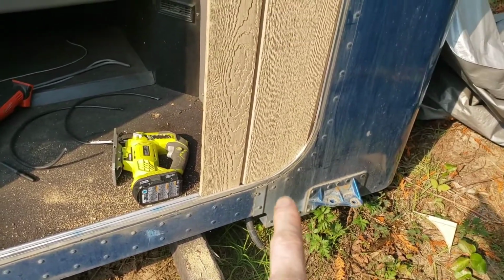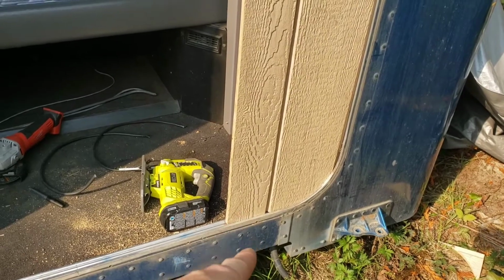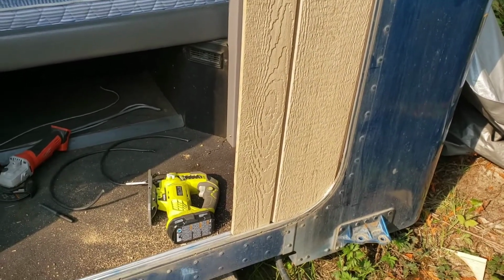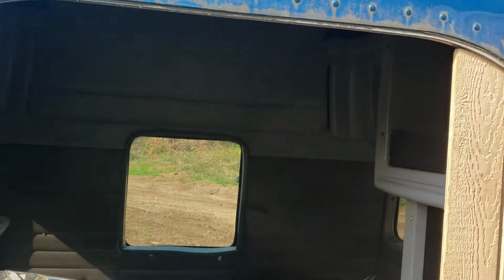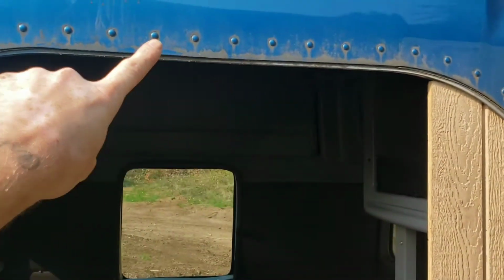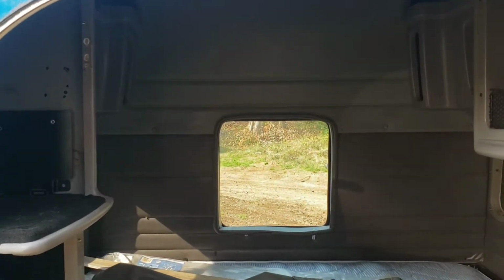So even though I don't want it to go down there, I'm gonna use caulking at the bottom, but I'm saying if moisture does get in there, it's just gonna drain out. So I'm feeling like this is the best plan of action, to make this inset like this, to where I'm not ending up with water issues at the top. I'm still probably gonna do a drip edge just because it's extra safety, but alright guys.